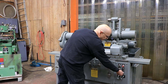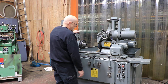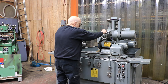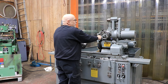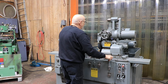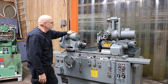If you don't want to use the spark-out for setting up, you have a timer to set the dwell time, but you can also shut this off. When you come forward, this is what you would do when setting up. You want to let this thing feed all the way down to zero — all the way to its dead stop. Then you can pull this out in the center and come up to actually touch off on your workpiece. You're moving the slide but not moving the back dial. Once you touch your workpiece, put this back in and go back out. Pull the pin in the rear, set this to how much stock removal you want to have. When you come in, it should touch the part and start grinding.